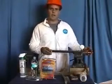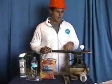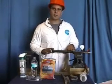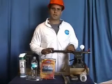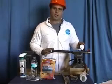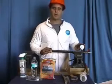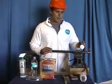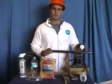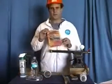Today we'll be doing a live leak repair on a 1/8 inch pinhole on a 1-inch OD pipe. We'll need access to regulated compressed gas at a rating of 60 psi. So we have a gauge here to determine if the gas has been regulated to the recommended rate of 60 psi. I will connect the compressed gas once we finish the surface preparation and go into the repair. I'm going to introduce the materials.